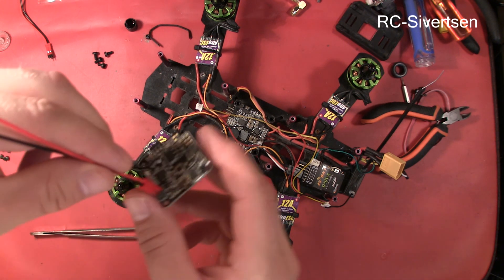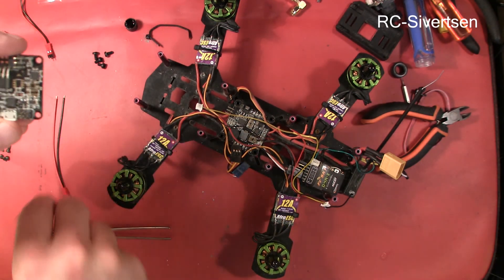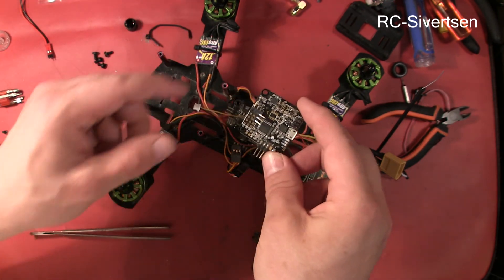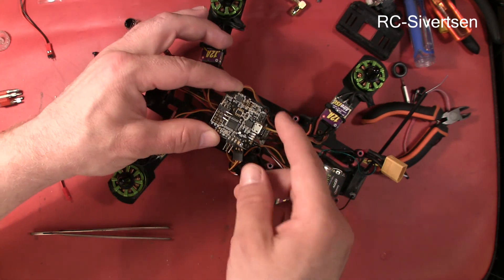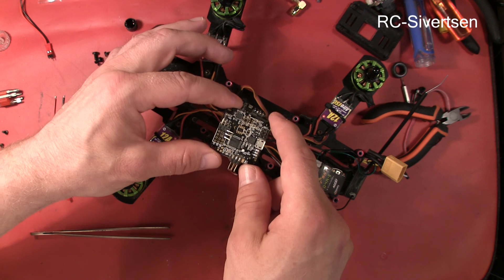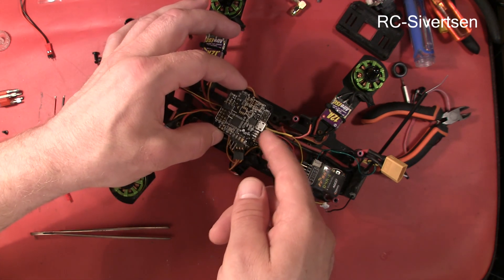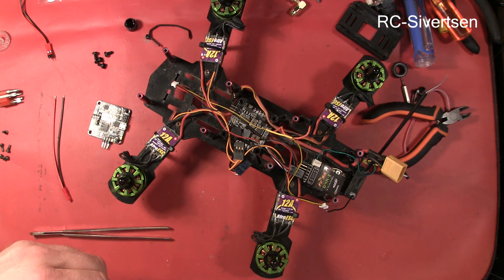After you have connected the buzzer you will also have to connect it in Cleanflight to hook up the buzzer. I also think while I'm doing this I have the NAZE board connected with the arrow in the front, and that meant the USB cable came in the back which was a real pain to access. So I'm going to flip the board to one side and configure the heading of the board in Cleanflight.